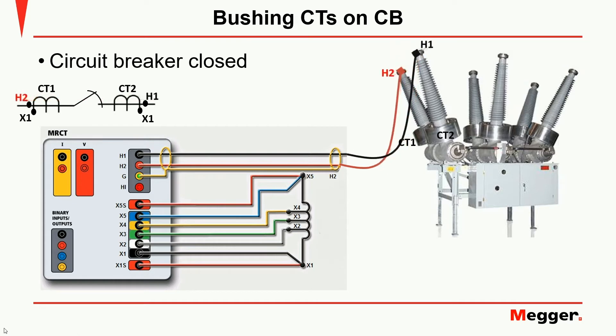In order to avoid the wrong polarity, we could swap the high voltage leads at the breaker. In this case, the polarity of CT2 will be correct after the test. Another option is to leave the connections as they are and use a little known feature in ITMS known as simulated primary lead swap.